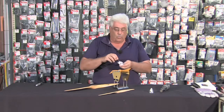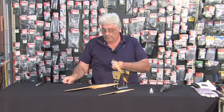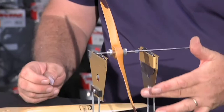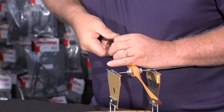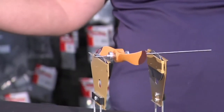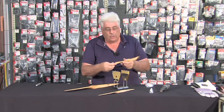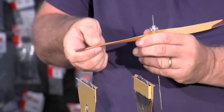To get it absolutely 100 percent you'd turn the air conditioning off. For starters I just use tape — that's all it is. Take a really small bit of tape, even a little smaller bit for this one. You want to put it on the lighter end. In this case this blade here is the heavier blade and this is the lighter blade. Put a little piece of tape on, put it down again — and look at that, it's now gone the other way. You can see how sensitive the balance is: half an inch of tape made it tip the other direction.